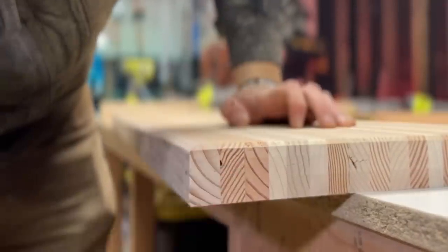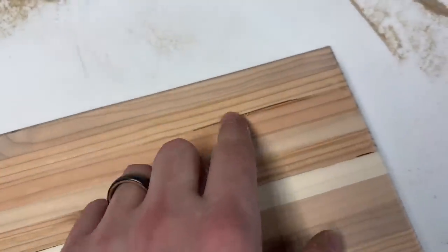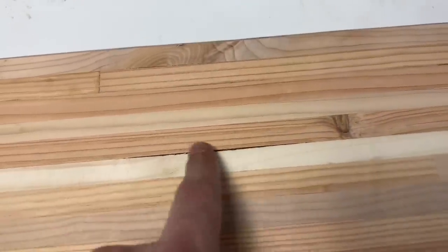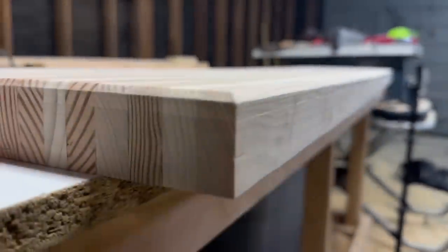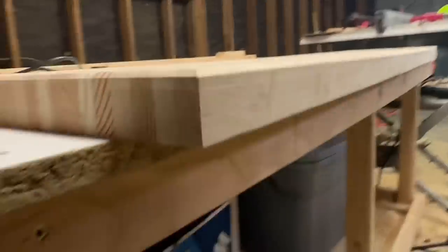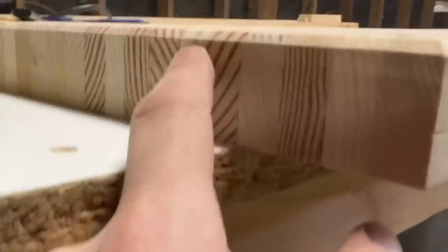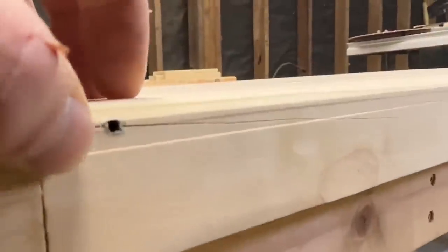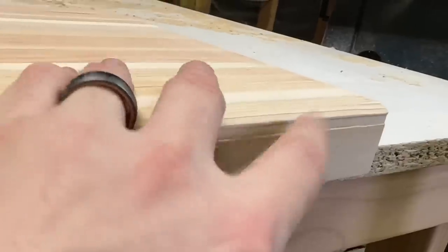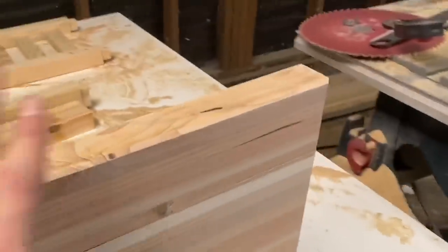Now I just give it a quick hand sand and get ready to put this thing together. I want to point out a couple of blemishes — a little bit of chip-out when we ran it through the planer, a couple of gaps from the glue-up, but the top is really nice and very flat. I'm very pleased with the result. What I also wanted to point out is what happened with my router — a lot of these bits have bearings which act as stoppers. Pine is so soft that the bearing left an impression in the wood, cutting in quite deep in some spots. I'll buff that out with the sander, but something to look out for when working with soft wood.